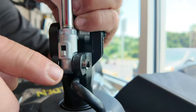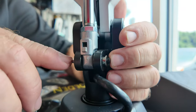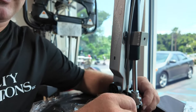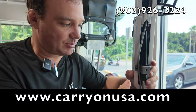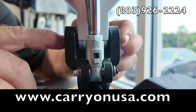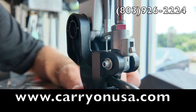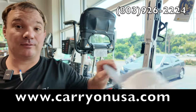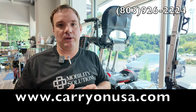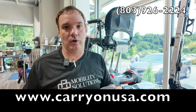They have done some changes to the GB120 TSA — they put these little locking washers over here. This is preventing that thing from coming out. So if you're repairing this one, you've got to take this off and then knock out that little sleeve. When you put this back together, put this on first before you put that bolt through there. If you have any problems, it is a little bit tricky. It's kind of hard for some people, so just go by your local dealer — there are a lot of local dealers and repair centers all over the country.